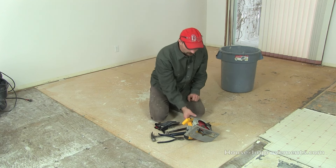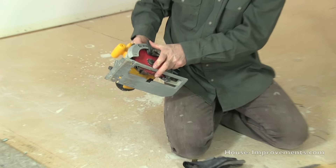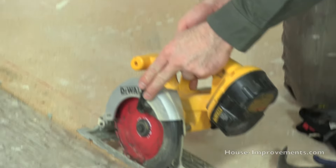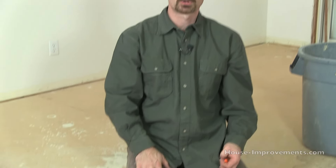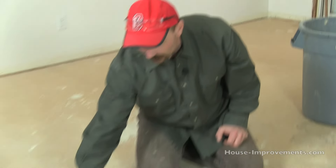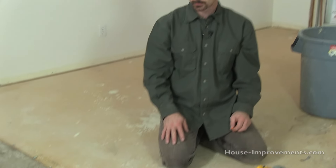What I've done is taken the circular saw and set the depth of the blade — basically laid it along an edge like that — just deep enough to get through the underlayment we want to remove. It's alright if you score the subfloor underneath it just a little bit, but you want to avoid cutting into the subfloor very much at all. If it just skims it a sixteenth of an inch, that's not a big deal.